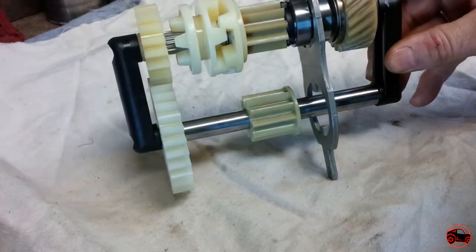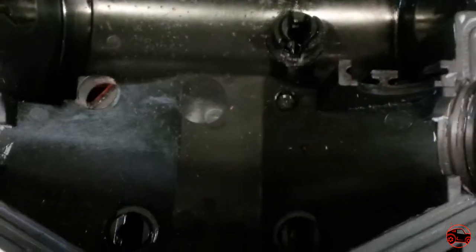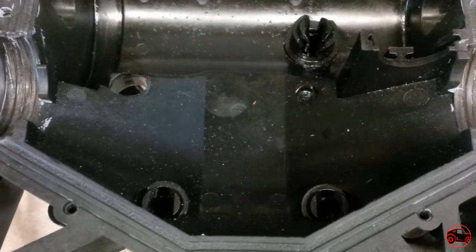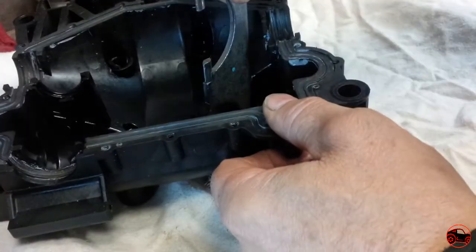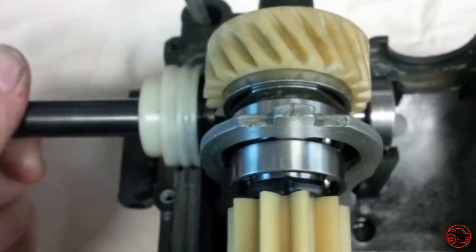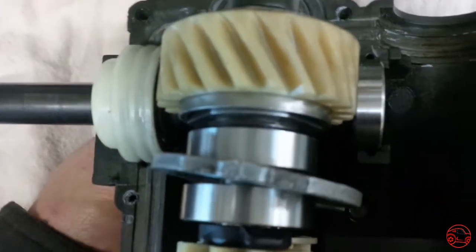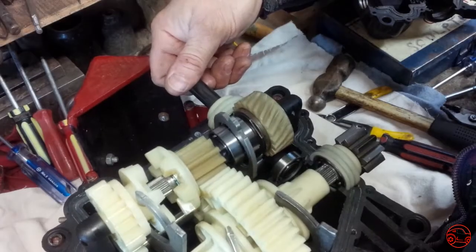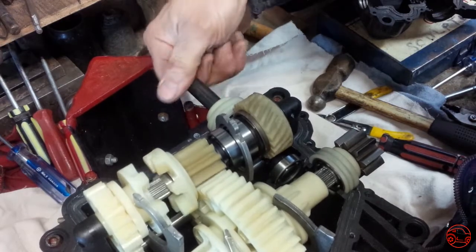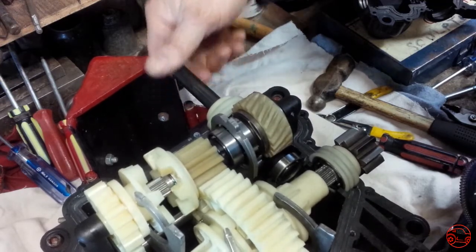Once the forward assembly was installed I completed the main assembly with the lower parts. Earlier during the day while I was waiting for my ball bearings, I removed the silicone on the edge of the housing and on the plastic rings. When I finished the installation of the lever, the worm gear, the shaft and the main assembly, I tested the clutch by rotating the clutch lever between the two ball bearings. It was working fine, so the first section of the assembly was completed. The second section was for the traction. I checked if the wheel gears were turning normally, with or without the clutch engaged.